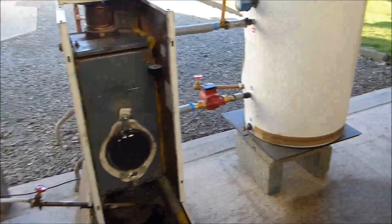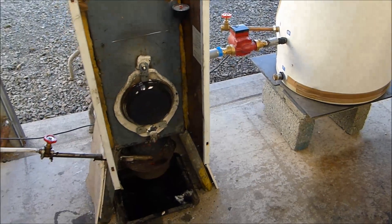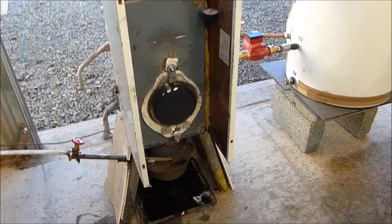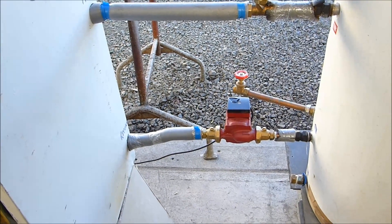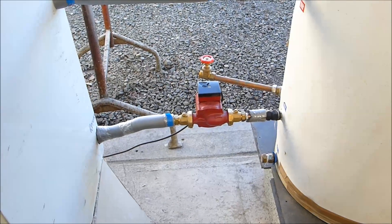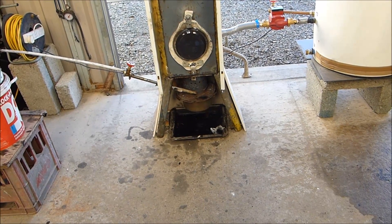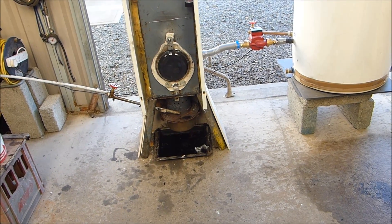The main reason for checking out the boiler with the hot water storage tank was that the tank represents a heating system. If it can absorb 20 kilowatts to raise its temperature to 60, 70, 80 degrees, well then it can do that for a heating system as well. With the addition of a pump, a circulation pump, and pipes connected into a heating system — radiators, underfloor heating, whatever — and a domestic storage tank, it's possible to heat a reasonable size house. That's with a 70,000 BTU boiler. Nothing's stopping that particular burning unit, maybe with slightly larger holes, doing a 200,000 BTU boiler — no problem.